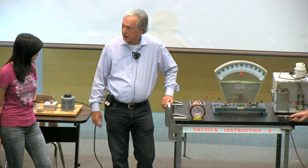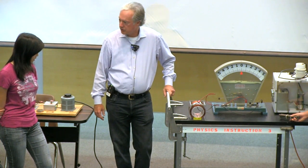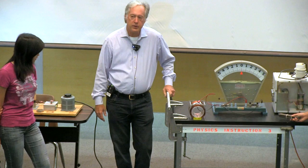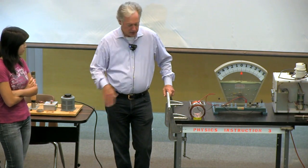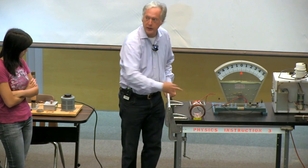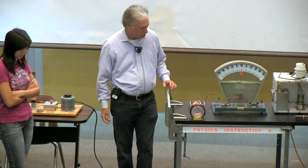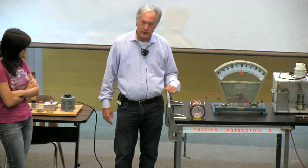It's made of copper, but does it look exactly like bare copper to you? No, it looks shinier. It has some varnish on it so that it's insulated with a very thin insulation layer. That allows the electrical current to flow along the wire but not jump from coil to coil, so they can be very closely packed without any short between the coils. Current goes in one, goes 3,250 turns and comes out the other.